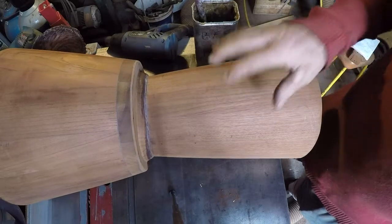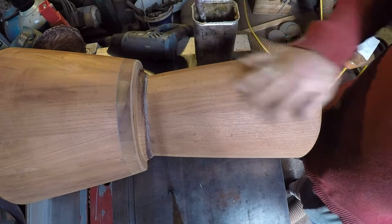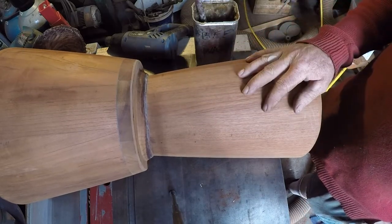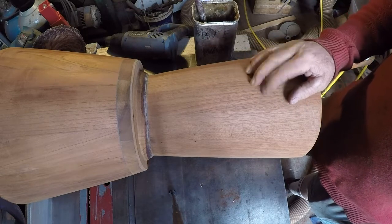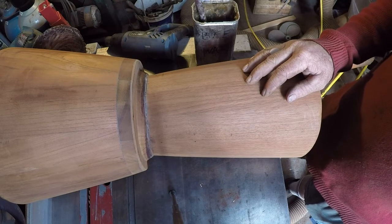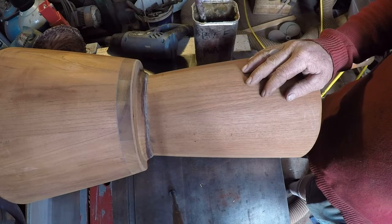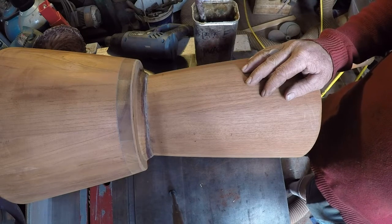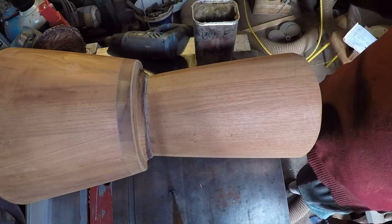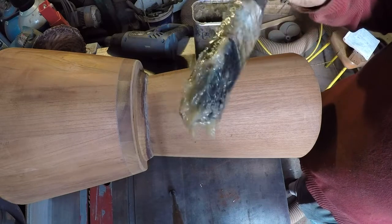My method of how I apply beeswax to timber to get a good even finish. So firstly, I'm mixing the beeswax. I just break it up into pieces and throw it in a container with gum turps. You gotta leave it for about a week or so, give it a bit of a stir. Might have to add more gum turps. Just keep going until you get a nice pasty sort of consistency. You can see sort of what I'm getting at over here.